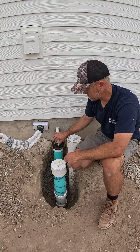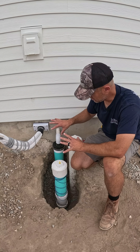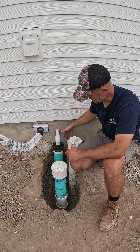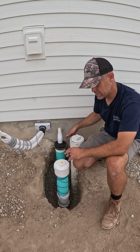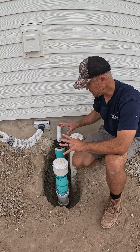One of the things I didn't want to have happen on this house — I didn't want to have water just dripping by the house. This is on a crawl space. We've actually waterproofed very well behind this with a good waterproof membrane and a dimple board all the way down, and we've caulked our footings, everything with a French drain. But I wanted to get the water away from the house, not dripping.